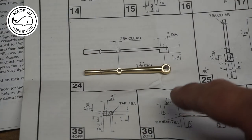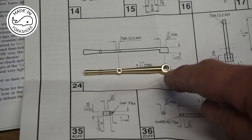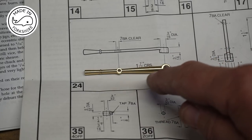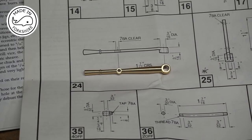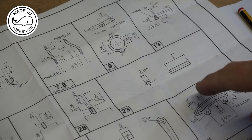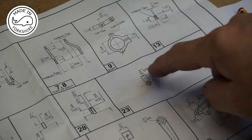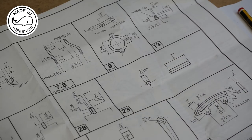It's not perfect — the large hole here is slightly off centre. I don't think that matters too much, but it would have been nice if it had been perfect. The main thing is the distance between centres, which are spot on. So now I'll go on and make the pin that holds these together. This is item 23, using a piece of 3/16ths bar which just needs to be cut down to 7/8ths of an inch. I'll do all that off camera.